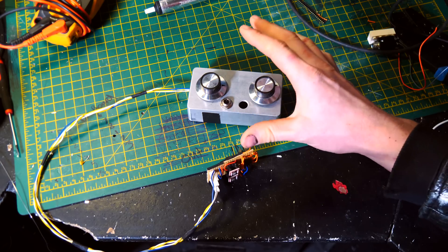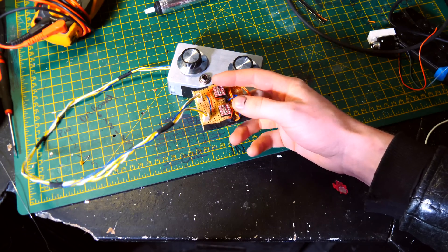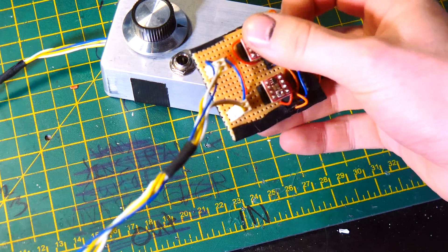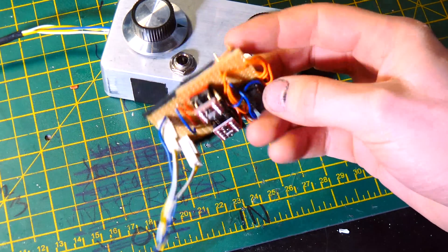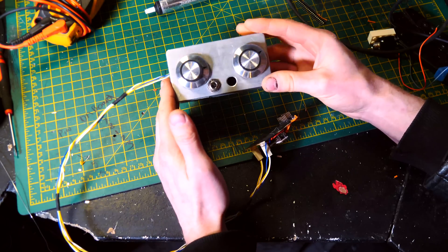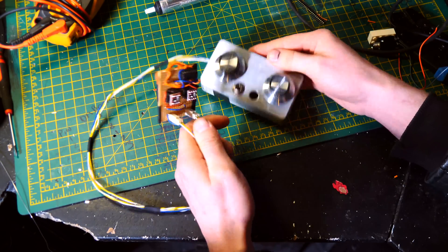So after doing those tests, I basically built this monstrosity right here, which is basically two of the LTC 1799 chips wired up to take over from the binary counter chip. You can switch between using these modified CPU clocks or go back to using just the binary counter. This basically plugs straight into the motherboard. I don't want to drill any holes into the Commodore PET, so I've built this to sit on the front of it as the control interface. Needless to say, it has control voltage in.